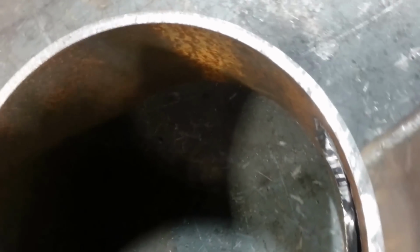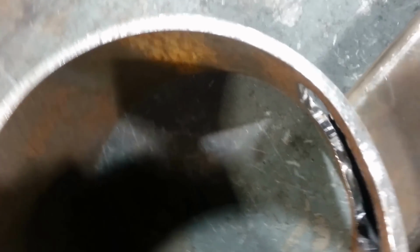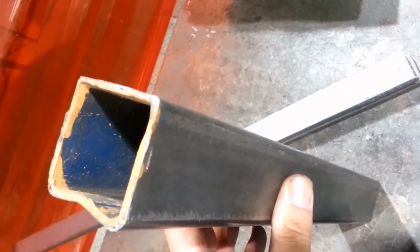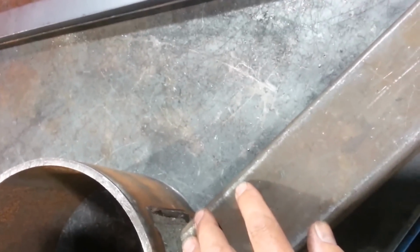Well, in my view, you guys can correct me if I'm wrong, or time will tell. If I put a small entranceway like this, I'm limited to 1.5 to 2 inch pieces of material that I can put down. Whereas if I put a larger piece of material in here, it can be long and skinny, and if it sort of kicks a bit in here, it's not going to get jammed in this. At least I can limit the size I put into this one, but I can't increase this one any bigger than that. The way I look at it, I'd rather have a larger inlet and realize the limitations of the machine just through trial and error.